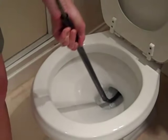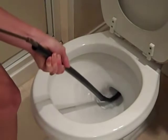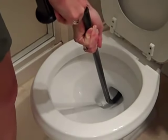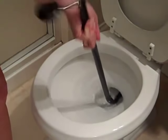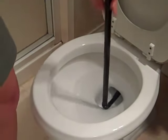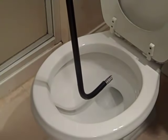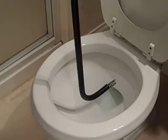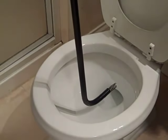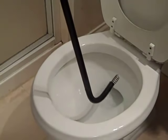The hardest part is getting this whole metal snake to sneak its way through the toilet. Turn the handle when you get it all the way down, then turn it the other way. Keep the plastic part in, pull it back, pull it out, and flush. Hopefully this has shown you an easy way to learn how to snake a toilet properly. Please practice this — I wish I had before I had a problem and really needed to use it. It really works so much better than a plunger on the low flush toilets.